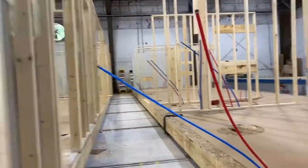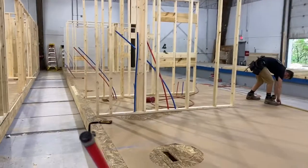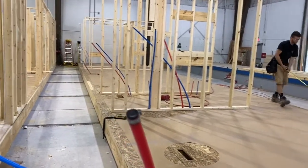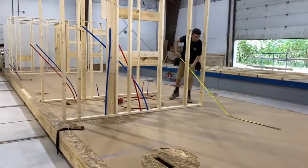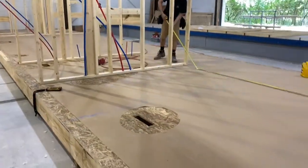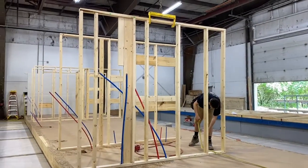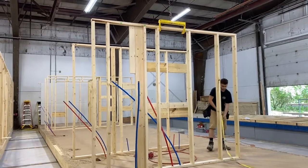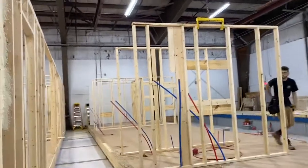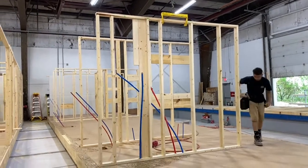Got the deck here, they'll set the end wall first, and that long wall that's built in there will go right here. You can bring it over with the crane and set it right in there. Wow. All the blocking for cabinets, kitchen and bath cabinets, whatever we put in the walls, we build them in. You know, we have some solid screw-through. Curtain blocking, high mounted TVs, blocking.